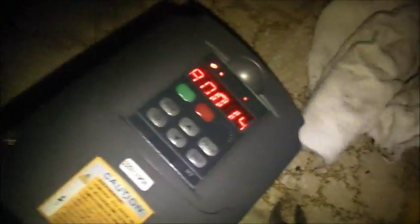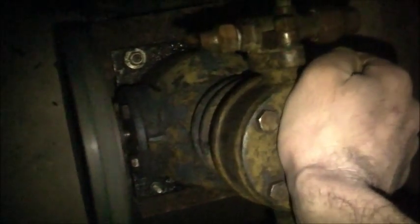Running at 100Hz was a good test, but I wouldn't run anything past that for very long — it's not good for it. It's getting up to running temperature now, just throwing it as fast as I want to run it. It's not supposed to run very fast, this compressor, so it might be too hard on it. It's a good little compressor.